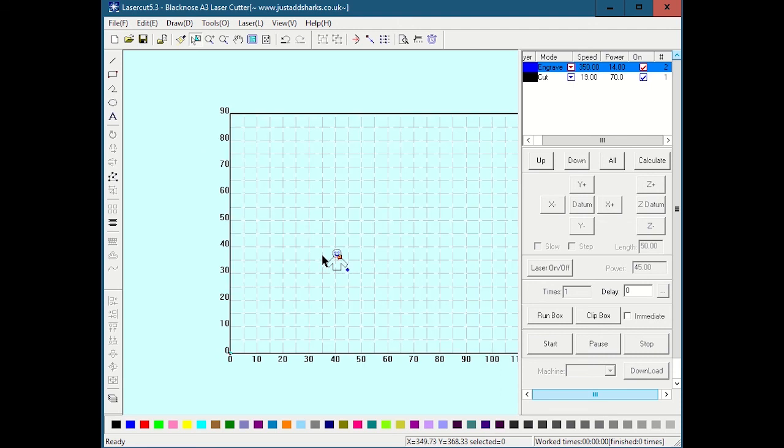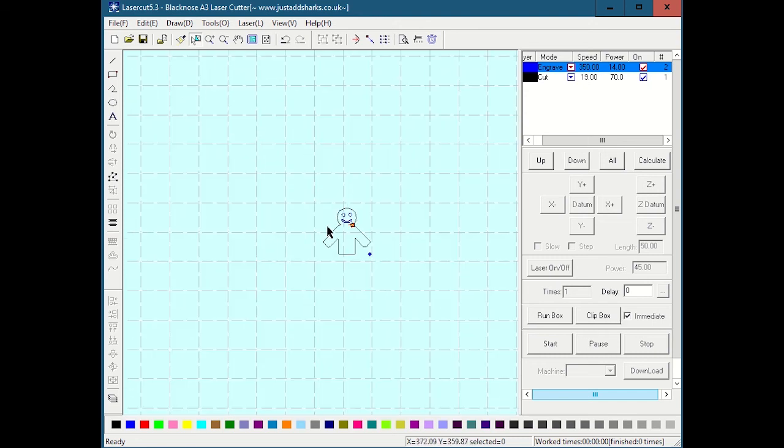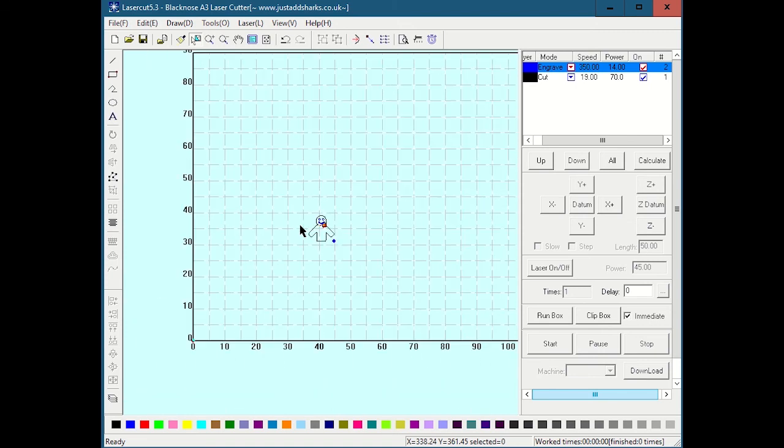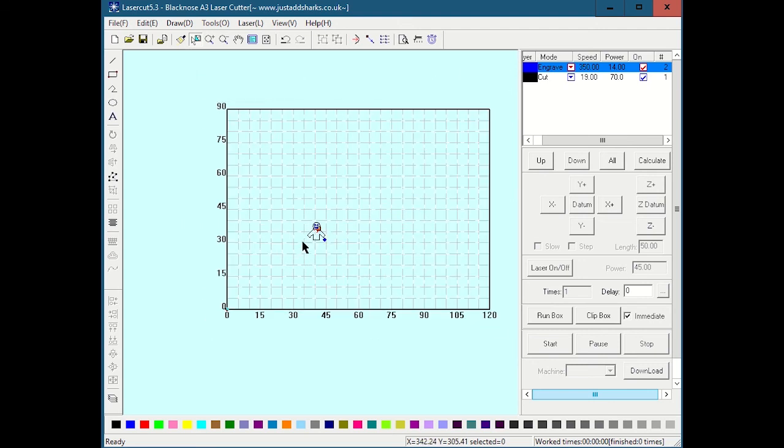So sometimes people get confused because this button right here, the LaserCut software will actually leave it set from the last person that checked it. So usually everybody leaves this thing checked, so they're always working relative to where the laser head is. But if the last guy unchecks this, what you'll see sometimes is you'll put your artwork in the bed, and let's say you expect it to be like 1 inch by 1 inch, and you have the laser somewhere, and you hit test and expect it to draw a 1 inch bounding box. The laser goes all the way over to the side of the bed and then draws a 1 inch by 1 inch bounding box over there.